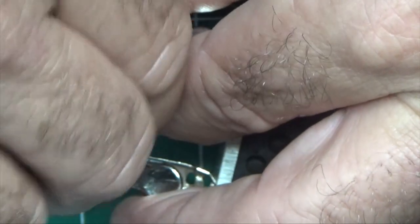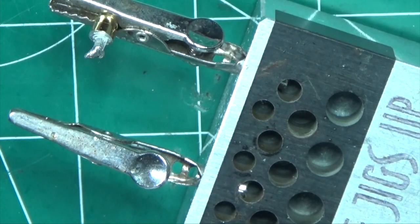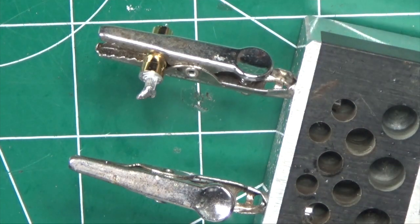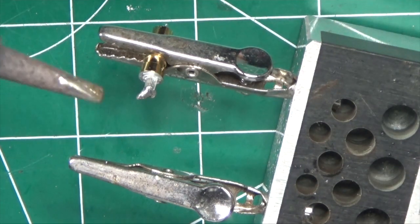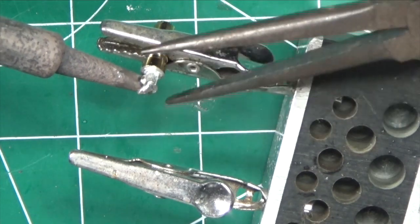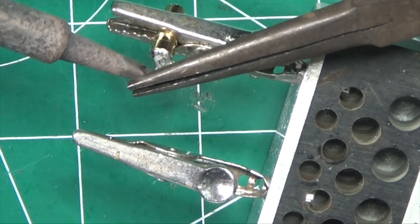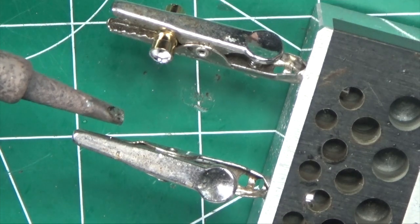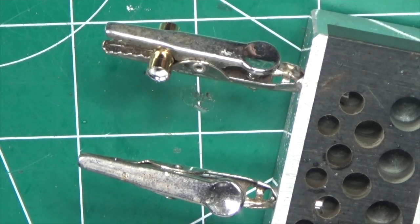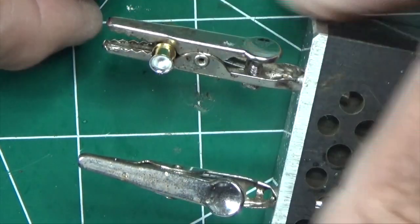Now we've got to do the next one. Same process — get rid of the insulation because it's going to melt like rubber and we don't want that on our soldering iron; it smells bad and makes it dirty. Now we've got to heat this up, get our needle nose pliers ready, get our soldering iron, and get a little solder on the iron. We're going to place it on the wire, heat up this battery connector as best we can, and pull it out. Remember, what you pull out is going to be extremely hot — don't set it down on something that can melt, and don't grab it with your fingers because you will get burned.